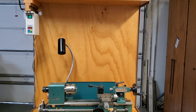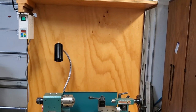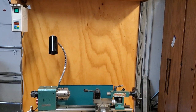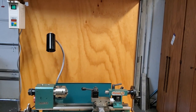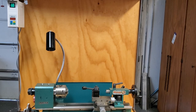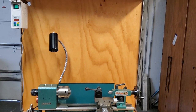I highly recommend you mount your control unit well above the mini lathe. Put it somewhere above, make sure it's out of the way of all the metal filings, oil, water, coolant, anything that may be blown off the lathe. If you put it beside your lathe or below your lathe, you will surely eventually be buying a new board for your control unit.